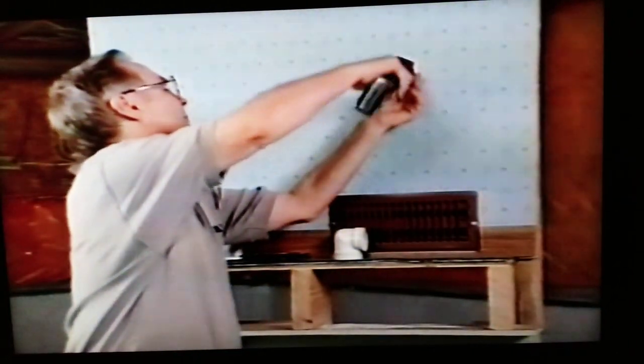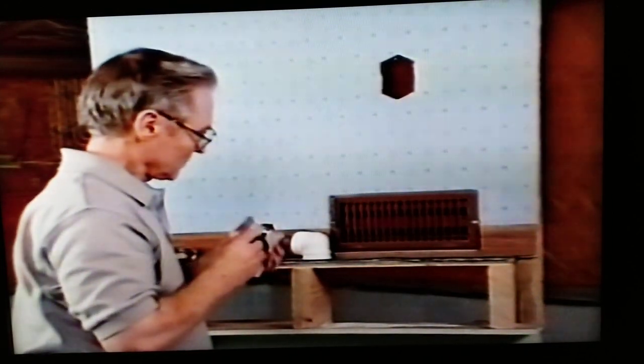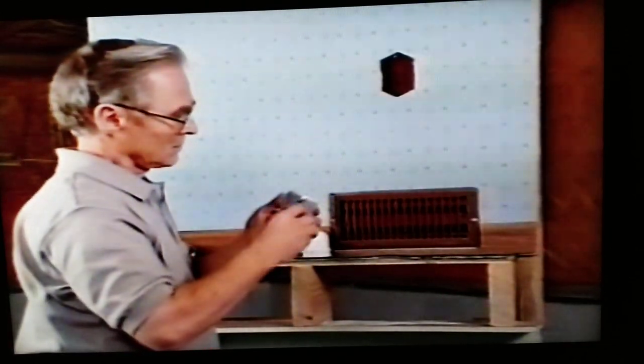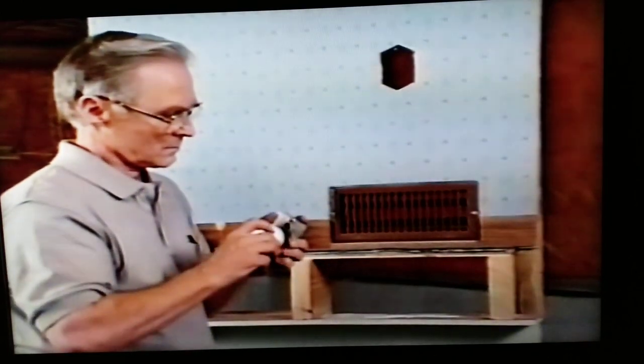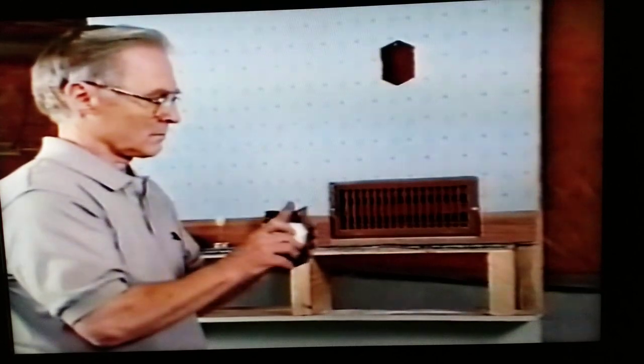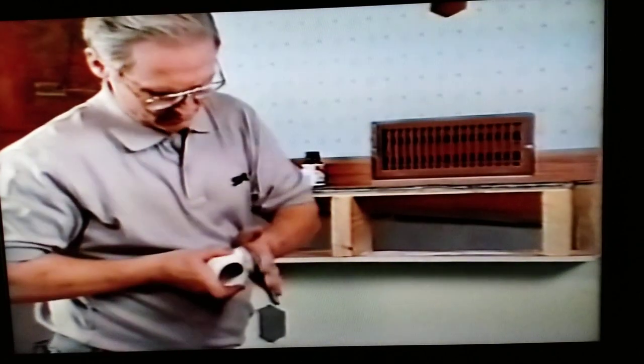Measure the inner wall cavity to determine which end — A or B — of the white sharp 90-degree elbow you'll need to glue to the ring in back of the metal mounting bracket. Be sure it's a white sharp 90-degree elbow and not a 90-degree sweep. Note the exclusive white sharp 90-degree fitting actually fits both ways depending on which inner wall space you have. In this case, the measurement shows a standard three and a half inch cavity, so glue side B to the back of the mounting bracket. Remember, in the narrower two and a half inch mode, you must shorten the bottom inlet valve screw so it doesn't pierce or obstruct the vacuum pipe later.